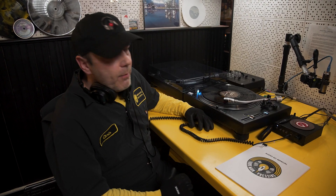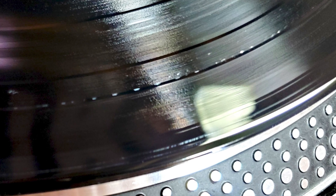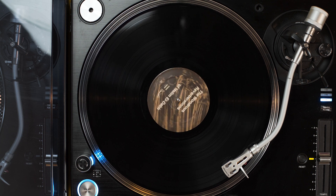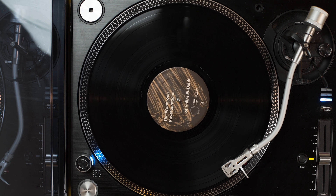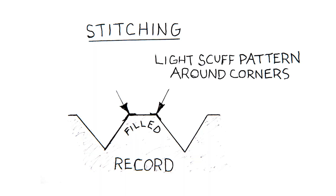What we have here is an example of stitching. Stitching is very common on presses. It looks with the naked eye like a row of dashes, dots, or stars. Stitching is when the press opens and tiny scuff marks appear on the top of the record where it meets the groove. Sometimes if they're severe enough they will kick up flaps of PVC and the little flaps will tear by in the form of a rip or a zip.